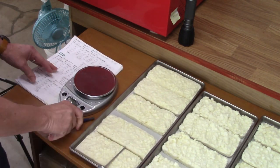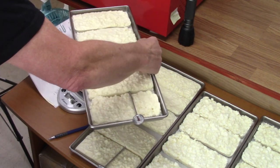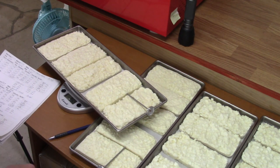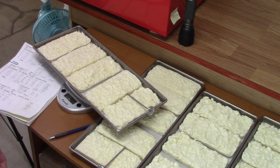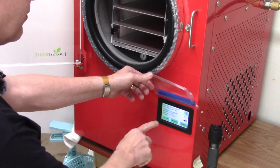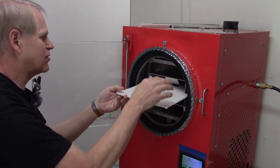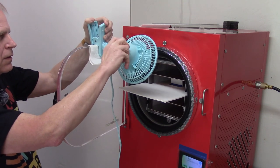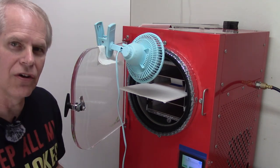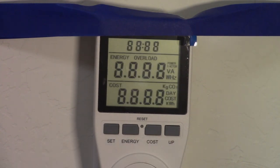Tray four — let me get the scale on the table. It's bouncing, so it's a fraction of one gram — good enough. Going to press no defrost. The weights are good. I'll get the defrost fan in place and the defrost baffle, get it defrosting, then get things moved over and ready to bag. Also, checking power usage: 27.14 kilowatt hours total — I'll reset that and get ready for the next batch.